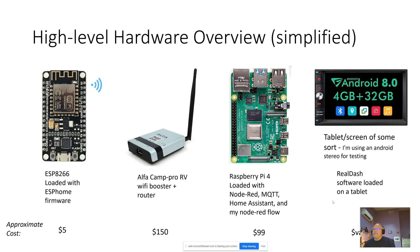Here's an overview of the hardware and software involved. I'm using ESP8266 NodeMCU chips loaded with ESPHome firmware, which is open source and free. These are very affordable, small, and relatively easy to work with if you're familiar with DIY electronics projects like Arduino. ESPHome doesn't require any real programming to configure — you edit a configuration file, and there's good documentation and videos to guide you.